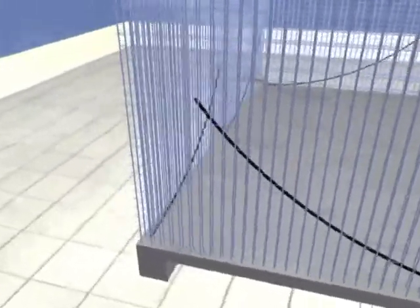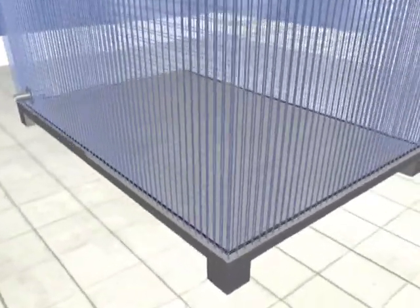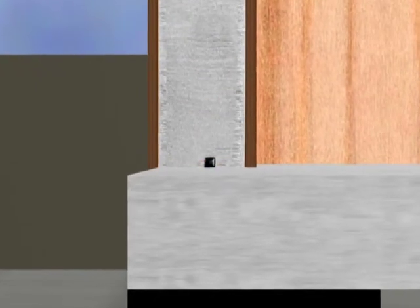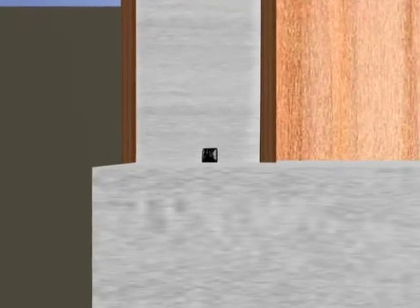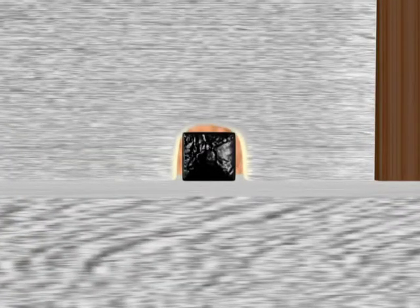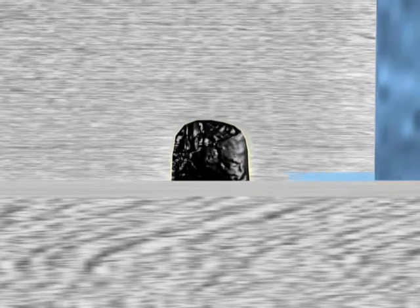After casting the base slab, you just have to lay Dr. Fix-It Waterbar. Then cast the first lift. Waterbar adheres firmly to the concrete. As it is a strip with a cross section of 20 mm by 20 mm, proper compaction around it is possible. Also, there is no chance for it to bend during casting. When concrete shrinks, Dr. Fix-It swellable water bar expands and fills the gap. Water entering the joint is stopped because Dr. Fix-It water bar has sealed the joint quickly and permanently.